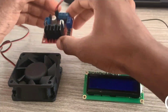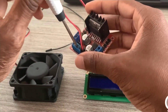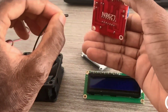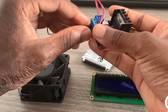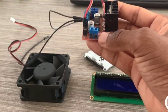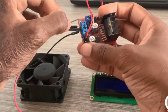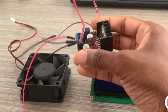I need this cable to connect to ground — that's the ground of the ESP32. Now I'm going to power the L298N motor driver using 12 volts. I'm going to connect the ground of the ESP32 to the ground of the driver, which is also joined to the ground coming from the 12-volt source.